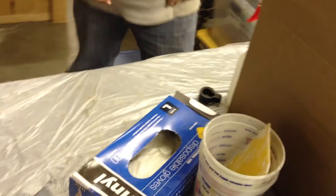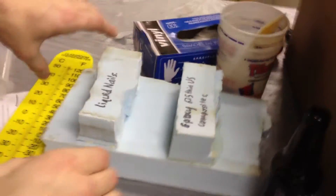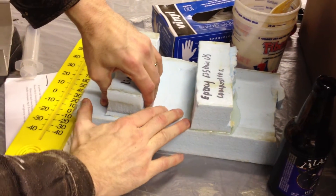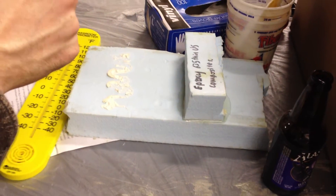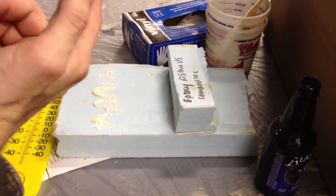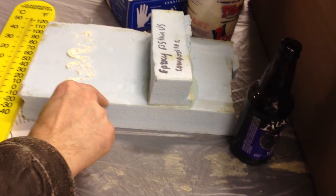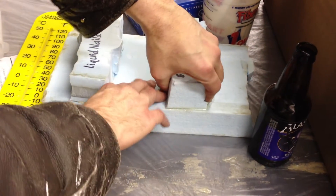So I'm going to try to pull these apart. Clay, could you hold this camera for a minute? I'm going to pull until it fails. Point at the foam if you don't mind. Here's the liquid nail side — there's both of my hands. Okay, I had to pull pretty hard. And it is still wet inside, so maybe it hadn't fully cured, although this has been out since Sunday and it's Thursday now — almost a week. Let's see if I can get the epoxy to fail.